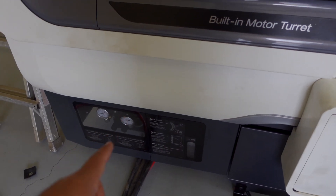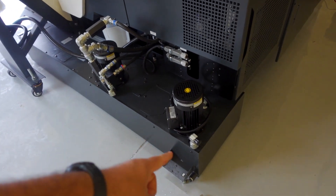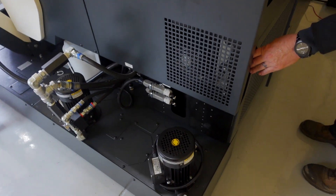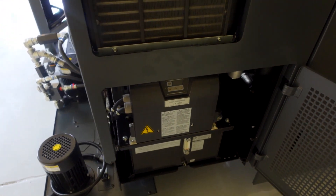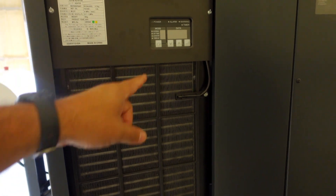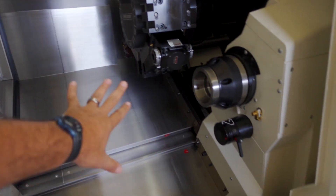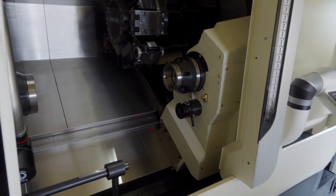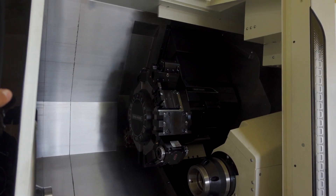Here it is, ready to go. This is where the lubrication oil goes. I have the pump for a hose wash-down. This motor — not plugged in, but if I need to I can plug it in here, hook up the hose, and run it to the front. This is hydraulics — this is where I'll put oil if I'm running low. This is the cooler for the oil. We're going to use 32-weight hydraulic oil. Don't blow this out with air — use the hose. Air will blow chips under the way covers and wipers, and you'll end up with shavings packed up in the bedways.